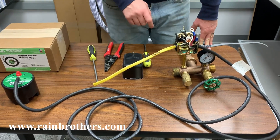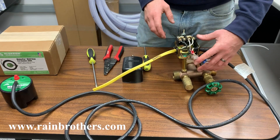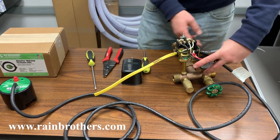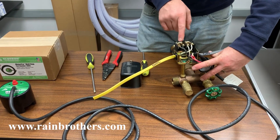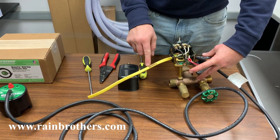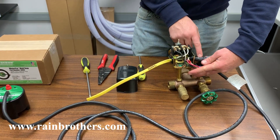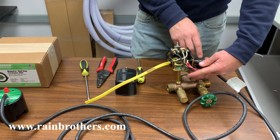For this demonstration, we're going to install it in a standard pressure switch. In this case, we have the pressure switch wired as it normally would be. We have the line supply coming from your electrical panel and then transferring power to your load end of things, which would be your pump.